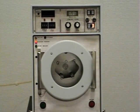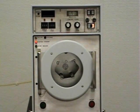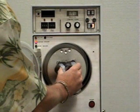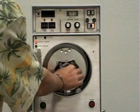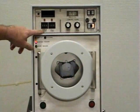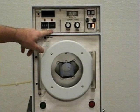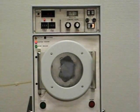Today's demonstration will be of just a small cassette of 2-inch wafers. You simply load the SemiTool from the front. We have 30 seconds rinse, a 2-minute dry cycle, which is 120 seconds, and you simply just hit the start button.